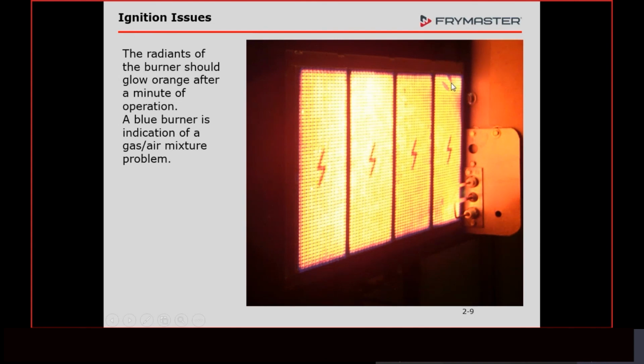Those flames are not very hot, just like a torch. If you just turn on the acetylene and light that, that torch isn't very hot. You get all that soot coming off the end from the unburned gas. When we put the air to this and set the air properly, just like you would with the oxygen for a cutting torch, that flame becomes extremely hot.